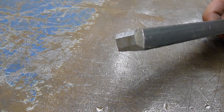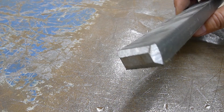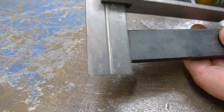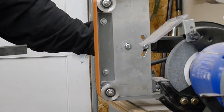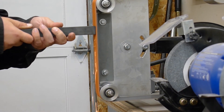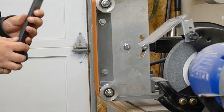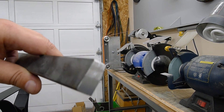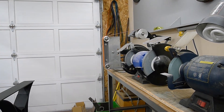Let's take a look at the end here. Not the straightest grind I've ever made, but I wasn't really paying that much attention to that — just removing some material. The ceramic belt that's on there has been on there for quite some time; it's seen better days for sure. A fresh belt will just rip. Just to confirm the size — it's half inch thick by one inch wide. Pretty heavy. Let's try one more time. About 12 seconds of grinding there — pretty much took the end of that right off. Again, this is a worn-out belt, and the surface finish is pretty good for 60 grit. Can't complain.